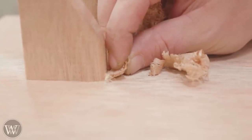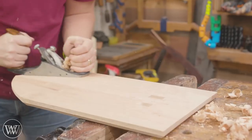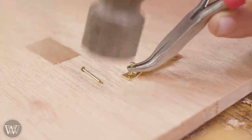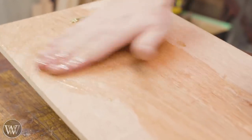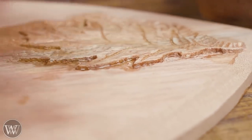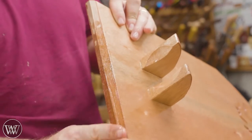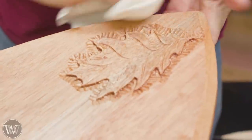You can see how they just pop out the back side — let that glue set and then we'll come back and clean it out. A low-angle block plane does a really quick cleanup job on the back of these once the glue has set. Then I came in to smooth the whole thing down on the back as well. To hang a hanging bracket, it's one of the few times I actually use a hammer in the shop. Of course we're going to finish it with boiled linseed oil, and the way this mahogany comes out is so pleasing — you can see that grain especially with the carving. The areas where it absorbs more or less start to bring out that texture, really bringing out the definition of that leaf. Homemade boiled linseed oil is one of my all-time favorites: smear it on with your hands, food safe, easy to apply. Let the wood soak up as much as it wants, wipe off the excess, then finish with a paste wax. Gorgeous, and I'm happy.